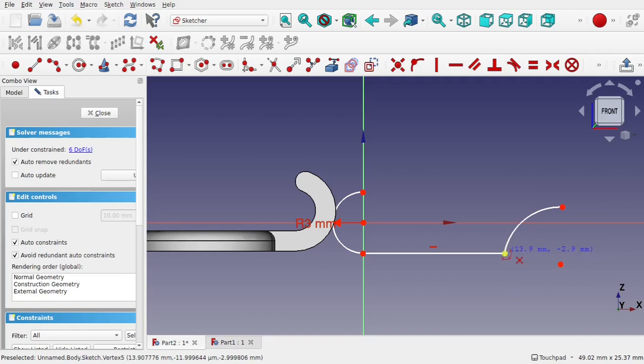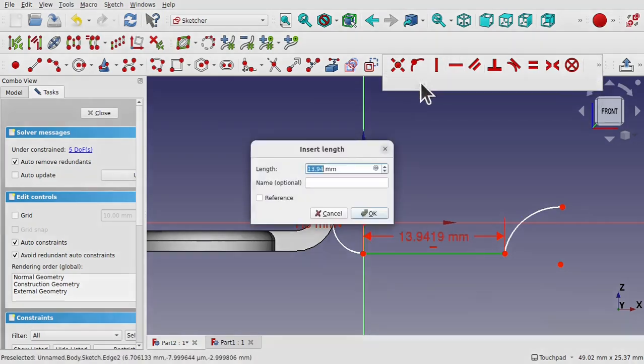So when I hover over a point, you can see we've got a coincident constraint there. So when I get to something like this, I would use a simple endpoint and rim point arc. With this one, because I was constraining to the vertical axis and the point of origin, I know I can constrain directly to these. So I use the other arc, the center and endpoint arc. So I have those constraints straight away in there. So I've added these in an additive way. I'm actually adding them to the screen, the different geometries, and constraining as I go.